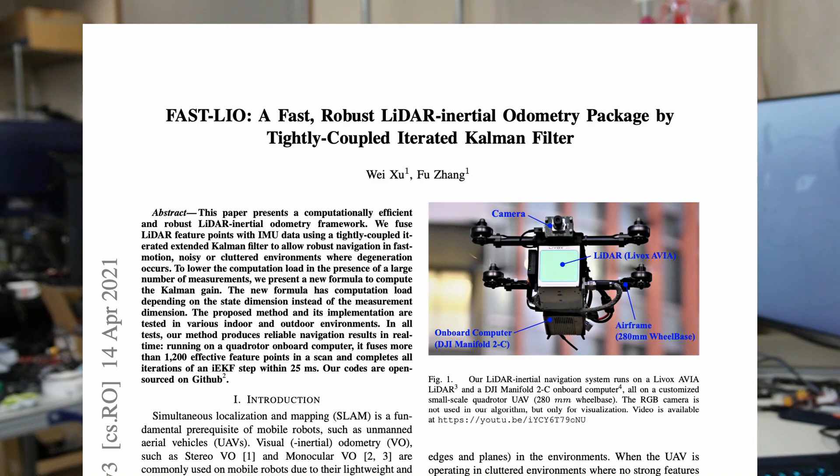Once Ubuntu OS is installed on the NUC computer, we need to install other necessary packages. I'm using Ubuntu 20.04, so I can install ROS1 Noetic and ROS2 Galactic from apt Debian packages. To control the AT crawler in ROS2, we need to install MD100A ROS2 Utils and ROS1 Bridge packages under the dev workspace with ROS2 Galactic. On the FastLIO repository, it supports ROS2 but you need to install it under Foxy or Humble — Humble is recommended. For the Livox Mid360, we need the Livox ROS Driver 2 package, also under Foxy or Humble. I built ROS2 Humble from source separately to run FastLIO and Livox ROS Driver. For easy package management, I created a Livox workspace and a FastLIO workspace and built each package in its own workspace.